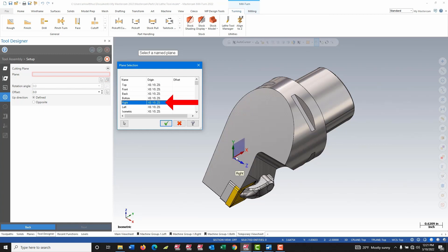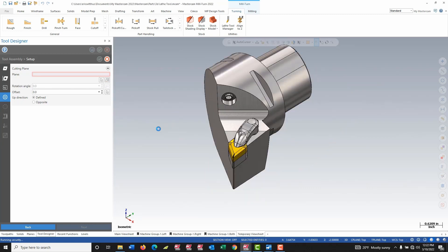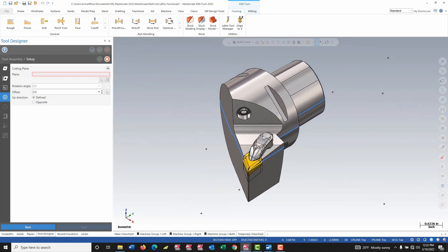As I work my way down the list I get to 'right,' and that Z would come off that face, so I'm going to select that one and hit OK. Now this is the first stage where I have to worry about how my tool is going to be orientated. I go to an isometric view, and with these Capto tooling in the multitasking machines, my head is going to be basically horizontal when it goes into tool change position. I want to define that tool in that orientation — I want it to be horizontal.